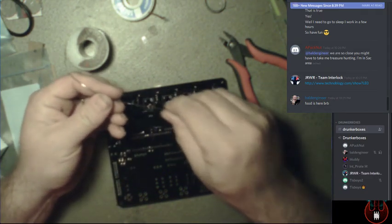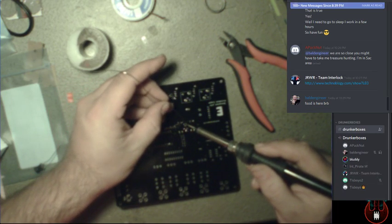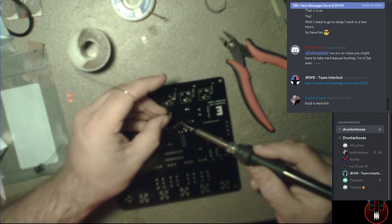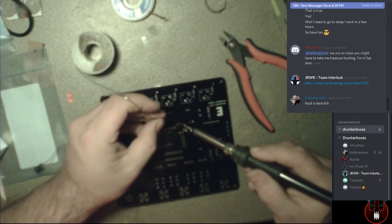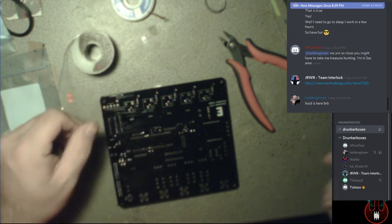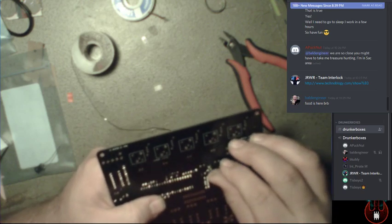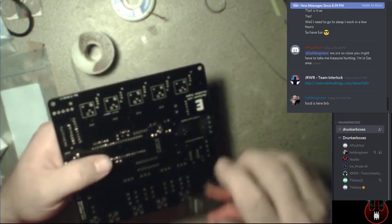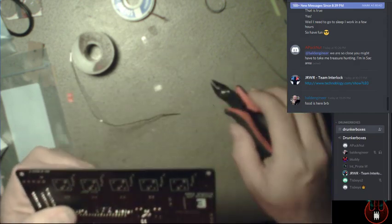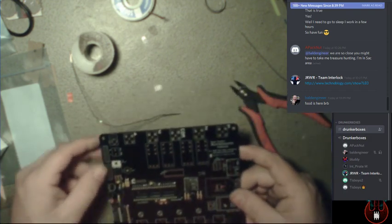It's a 10 LED badge. It's the Pirate Bay tape and crossbones logo. Oh, okay. I have 4 LEDs in the tape reel on each side, and they're bussed together, each LED for top, left, bottom, right. So I can do a circling animation with fading. And then I have 2 LEDs in the 2 guide pins at the holes at the bottom of the tape, and that's on pin 2. So those are flashers. It uses 2 2032 batteries. It does have the programming header on the back for the micro.